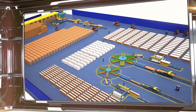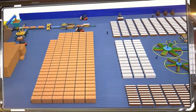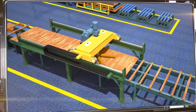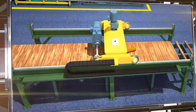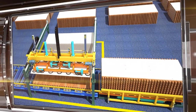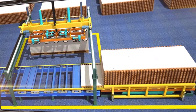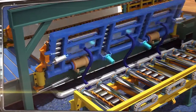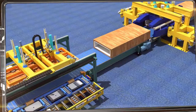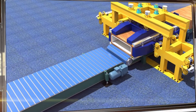The essence of our Green Home technology lies in the use of special organic wall panels. The production process begins by assembling plates from beams using rotor mechanisms. The beams are glued together to form a single plate. To give the plates additional sturdiness, flame retardant gypsum panels are attached to the inside of the sheaths. The next step involves assembling a box out of prepared plates of various thicknesses. The edges of the sheets are pressed again with hot glue, joined together and heated in an infrared oven.